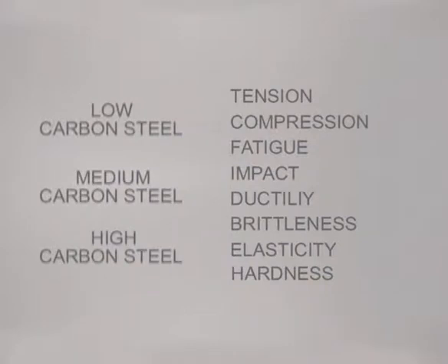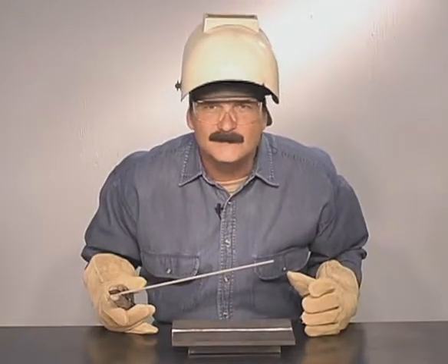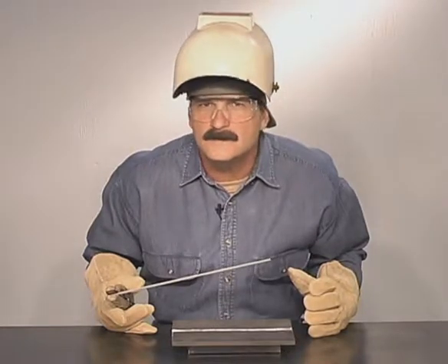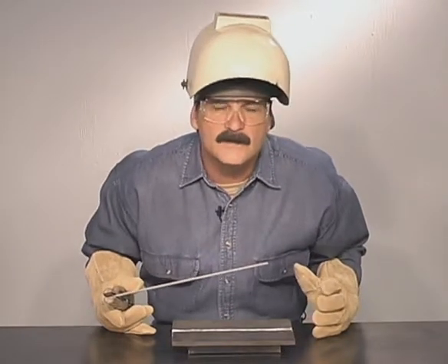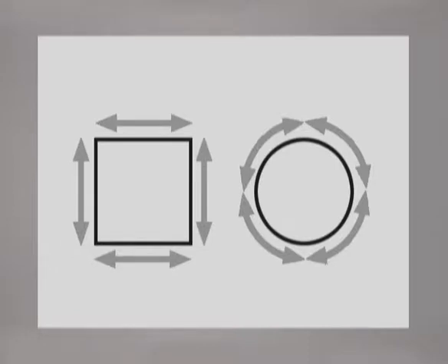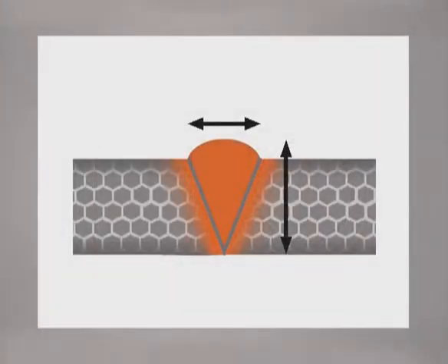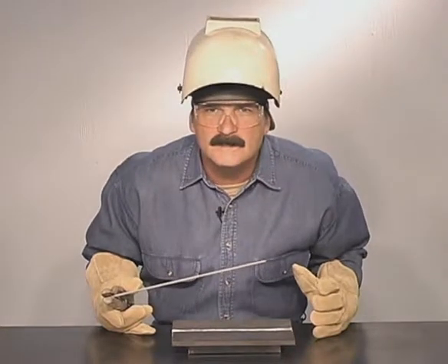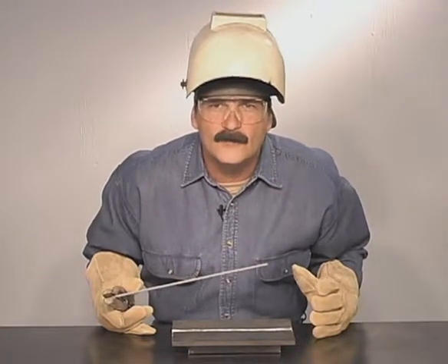As always, there are a lot of variables — the type of steel and the stress that will be put on the finished product. In most cases, projects are designed so that the stress put on the weld joint does not come anywhere close to the maximum strength of either the metal or the weld. Try to complete the weld once you start it and avoid building up more weld than necessary. When you're finished, let the metal cool slowly. If the metal does break next to the weld, you may need to take a closer look at the thickness of the metal being used and the overall design.